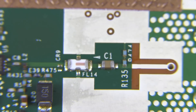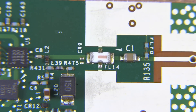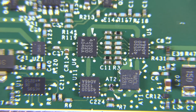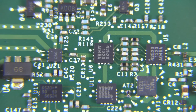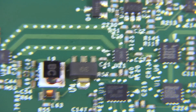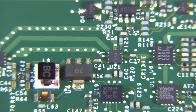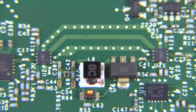We have a coupling cap here, and right at the start we have a little filter. You'll find a lot of filters of this particular type over this board. Those 42520 ICs are single-pole double-throw RF switches from 9 kHz through 13 GHz. Further on, we get a lot of these chips across the entire design with SMD markings '09C.' I tried to look for them but didn't find anything — judging by their positioning, I would assume they are switches, but I'm not certain.